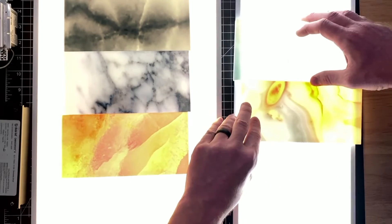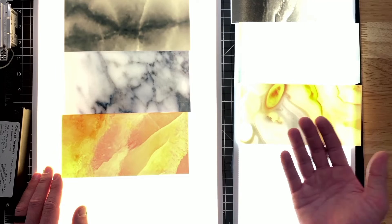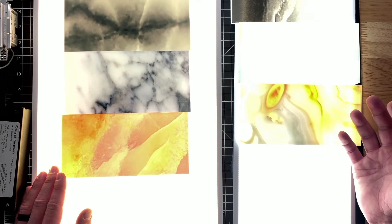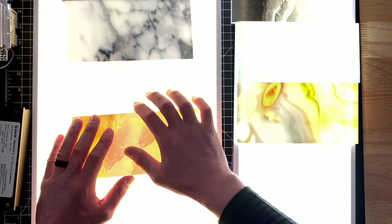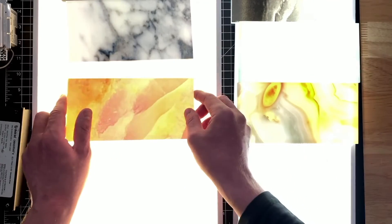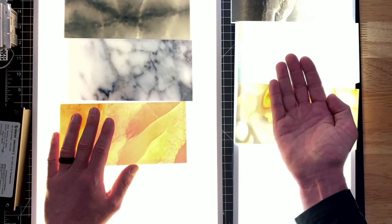Here are some different types of stone to show the difference when underlighting. Anytime there's actual texture in the stone, I suggest a higher CCT — anything from 3,500 Kelvin and up, ideally 4,000 or 5,000 CCT. With that crisper white light, you're going to see the veining in the stone much better and it will make that stone pop. For people who want a warmer look, use 2,700 or 3,000 Kelvin for warmer stones — anything with amber, brown, or red tones.